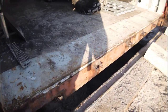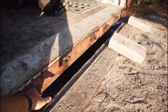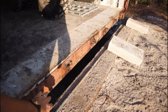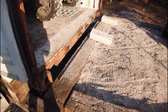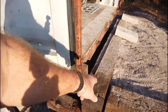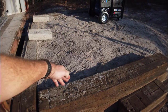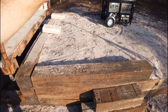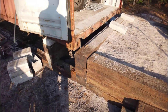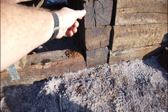I have the other one over there ready to be welded. What I'm doing with this piece is welding it from here to there so the pavers won't push through. Looking at it now, there's actually not enough room for them to push through anyway, so it may not be needed, but it provides some additional stability. Another option would be to weld a piece here, another piece out there, and a piece along the side — though that's probably a trip hazard as you're coming over the top, so something to consider as you design your layout.